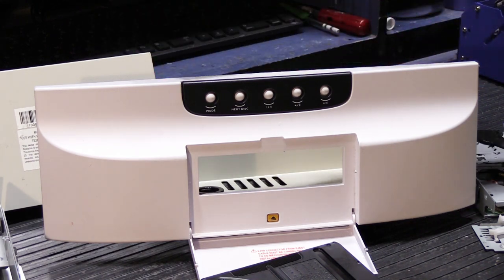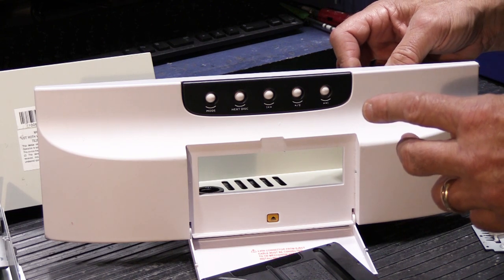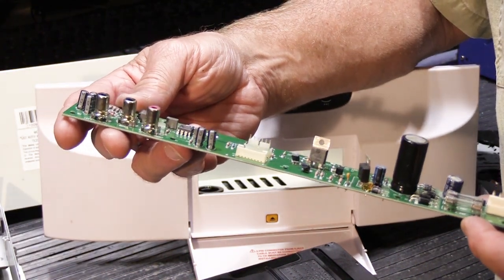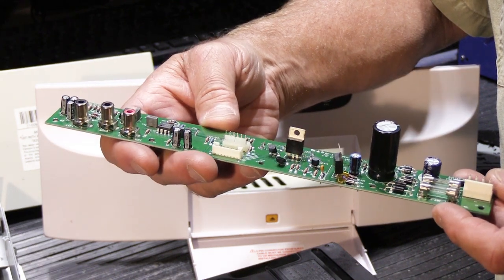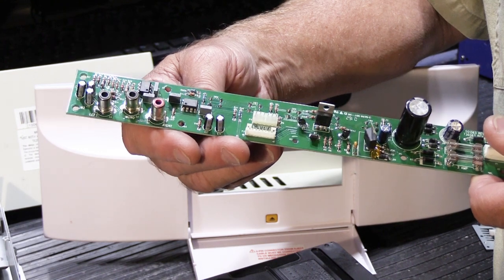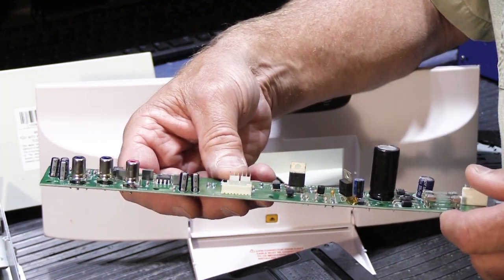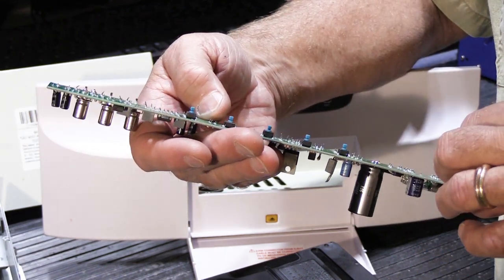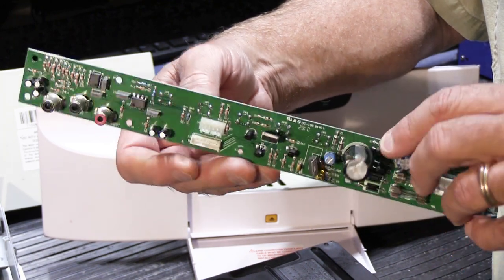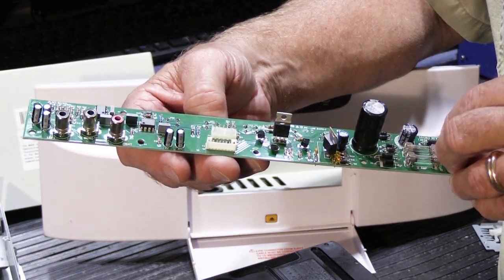The other things that tend to go wrong are with the interface card — the board with the control buttons that mounts on the back of the unit behind the push buttons. I've seen some where components on these overheat and burn up and fail, mostly because when the mechanism gets jammed and you keep trying to operate it, it overloads components on the board. This board also has the cable that connects to your master station, so it's an important part. It's fairly straightforward and could potentially be repaired.